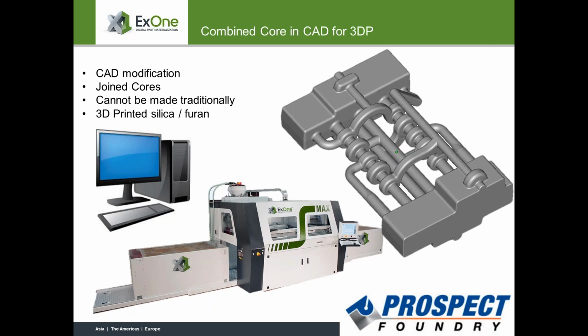And the benefit of getting the different cores, it's the same core, but different processes, different types of sand or amount of resin. The reason that's important is because different part numbers, different foundries, and different part numbers in those foundries, you might be fighting a different animal. Are you fighting an animal where the assembly time is killing you, or are you fighting the enemy that the trapped gas is killing you, or some other thing? So maybe the cores are breaking, et cetera.